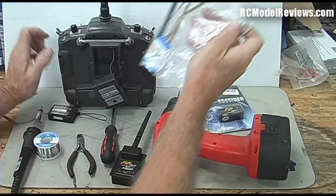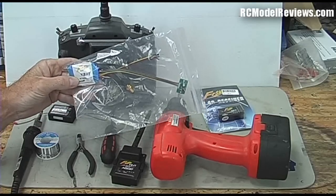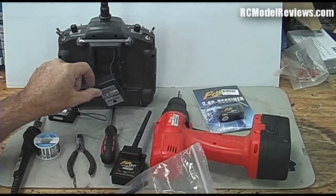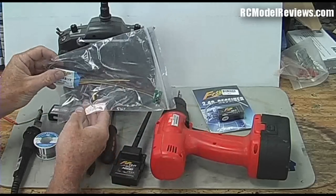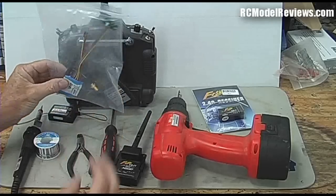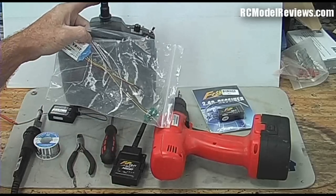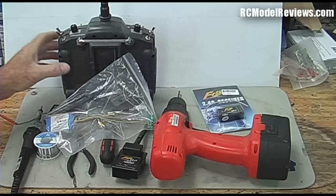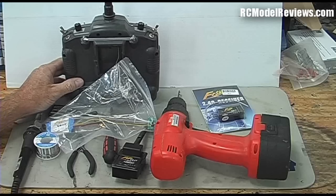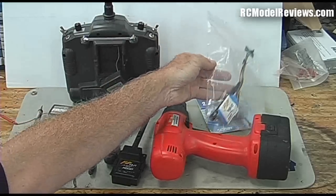The other problem is if we just cut that wire and stuck the module in, we'd have two 2.4 GHz aerials - one on the module and one on the radio. We don't want two 2.4 GHz aerials in close proximity because a lot of the energy from your module aerial will go into the original antenna. So instead of using a plug-in module, we're going to use the FrSky DIY kit, which can be had for a very low price. We'll put the DIY kit inside the existing module case so it looks nice from the outside.